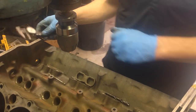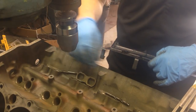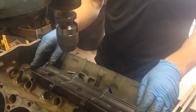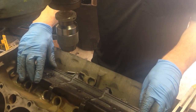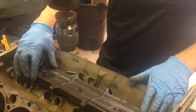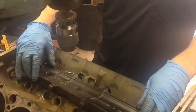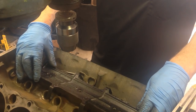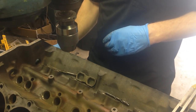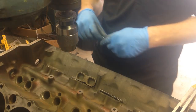So once you get your holes drilled, it's just a matter of tapping them. You can see this one here was just a little bit off center, but like I said, with this thing you've got so much leeway it doesn't matter. I got those almost dead center — I think this boss is just oblong here, because when I set this dead center in the middle, these holes are all lining up perfectly. They're right in the center of these brackets, so that's pretty good. Now we'll just set up the tap and go ahead and tap the holes.